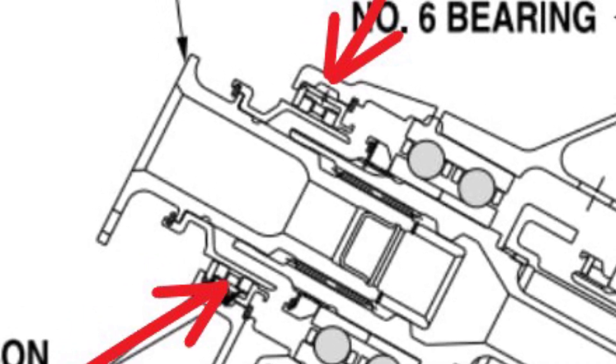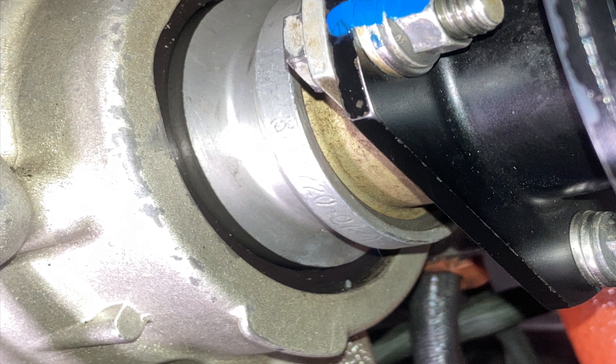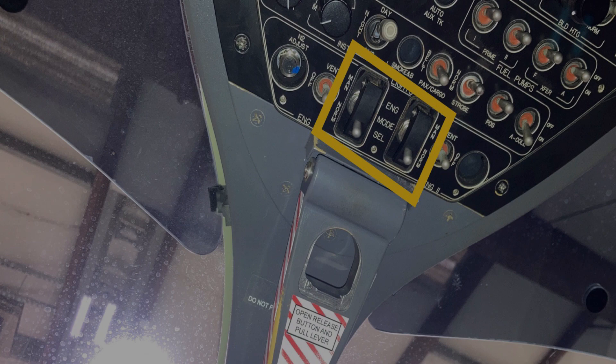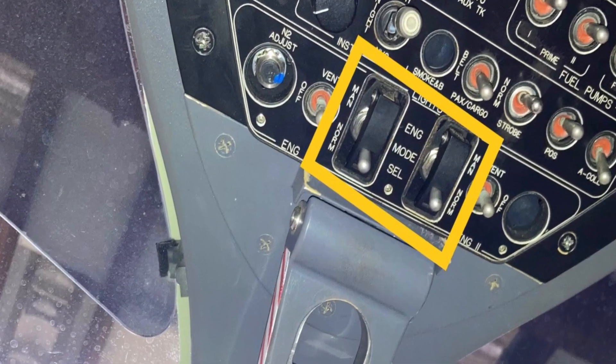Here's a picture of the seal — it seals the output drive right at the bottom of the lip. What you'll see is oil coming out or pooling there because the seal won't seal well when contaminated. This particular seal shown is clean and in good condition — there are some small particles visible but no oil coming out, which is good.